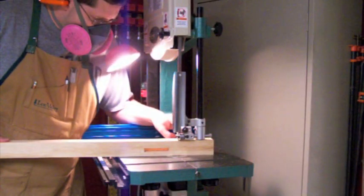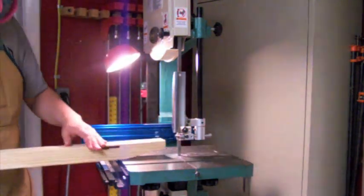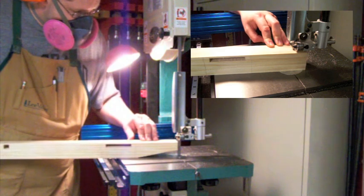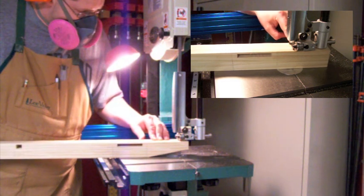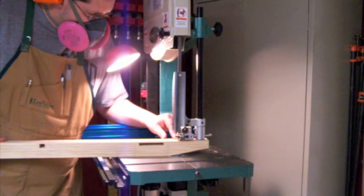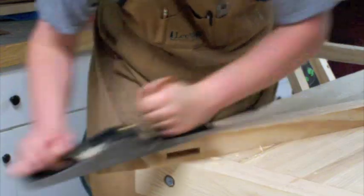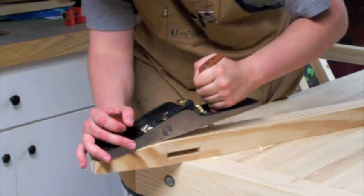For the legs, I simply marked out a diagonal so they taper down to a one-inch width at the bottom. I cut the first bevel, then flipped it over and cut the second bevel, taking the bottom of the leg down to one inch square. This second cut is a little trickier because the leg isn't fully supported — just keep firm pressure on the back of the leg. I'm using a Wood Slicer bandsaw blade, so I'll clean it up with my jack plane at the bench. Just a couple of seconds per face to get it really smooth.